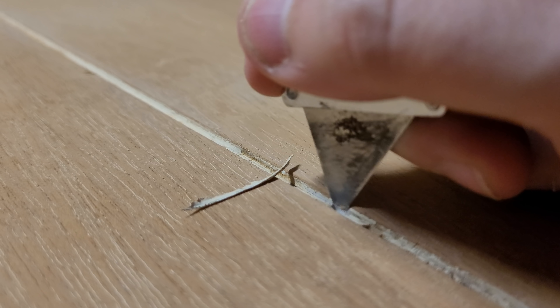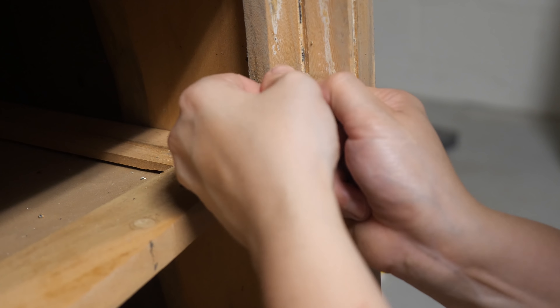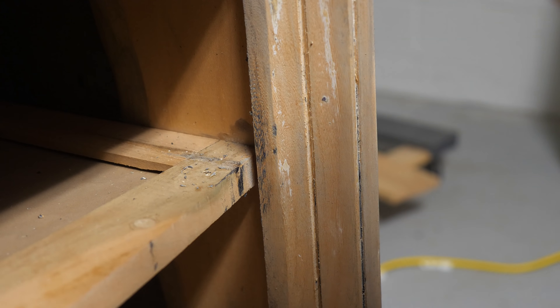Due to the numerous layers covering the wood substrate I'm going to use Clean Strip Paint Stripper to remove the paint with a 2-inch chip brush. I always use the 15-minute paste formula because it doesn't dry out as quickly as the liquid formula.